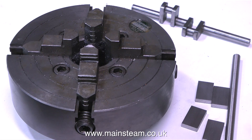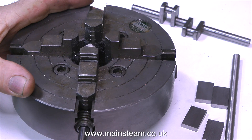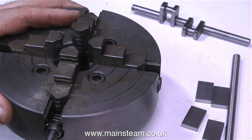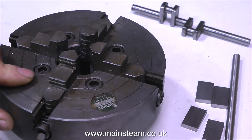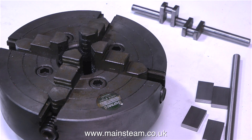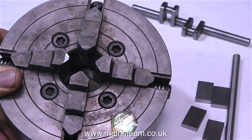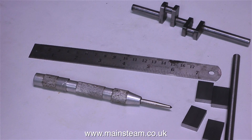While everybody's feverishly typing on the keyboard to tell me, here is my old four-jaw chuck from the Boxford lathe — I call it Bernard. Pretty much like me: very old, but some parts still work. The idea of a four-jaw chuck for raw beginners is that you can independently adjust the jaws to hold irregular-shaped objects, or position regular-shaped pieces of metal in a different position. This is what I'm going to be doing in the next episode — showing how I machine these pieces of metal that I've just been cutting.